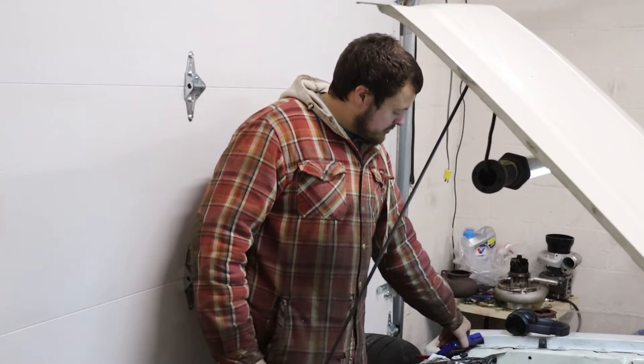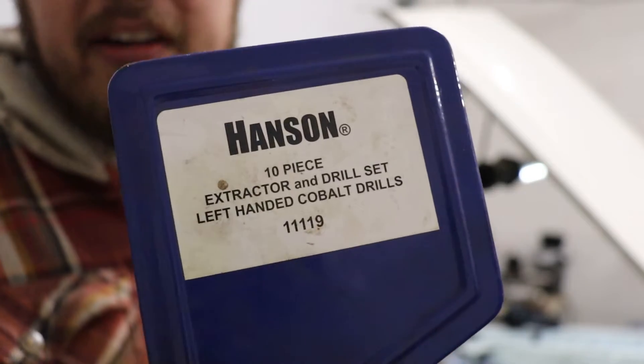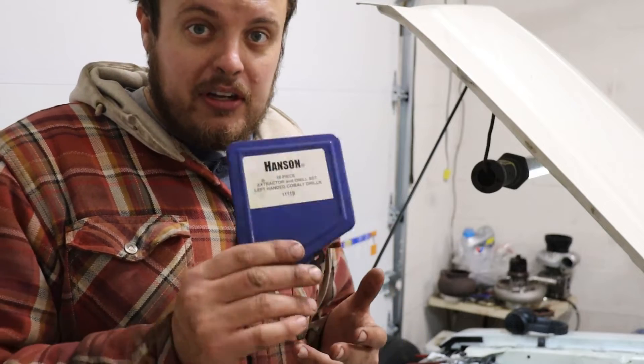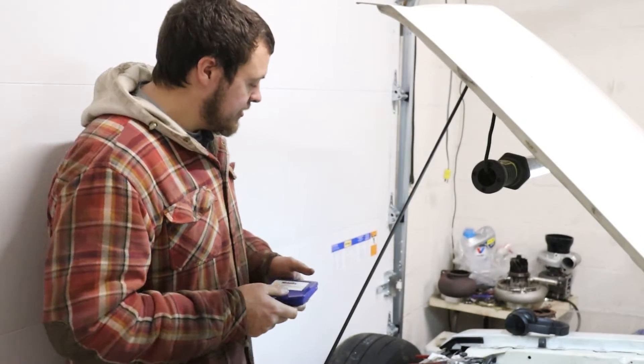The first thing you're going to need is one of these, which is a left-hand drill bit and extractor kit. Buy a brand new one of these, even if you have a set on hand, yours might be dull. It's really important to have sharp drill bits because it makes the job a whole lot easier.